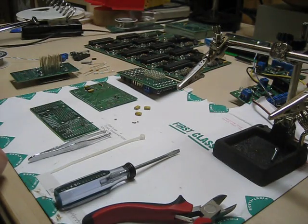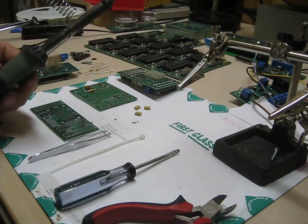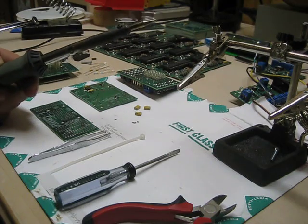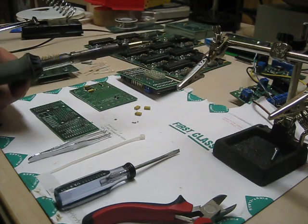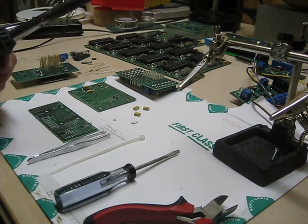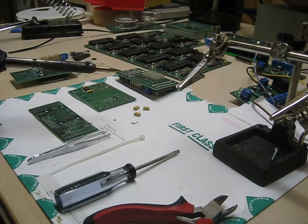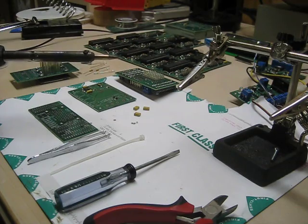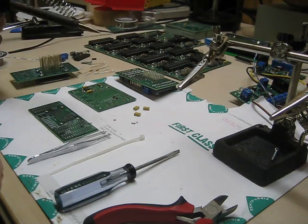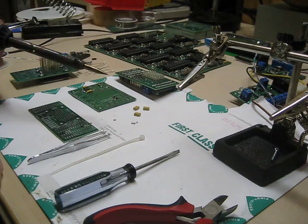The soldering irons I use — I have a regular solder iron with a large tip, about 40 watts. Anything less than 40 watts, you're not going to be able to heat it up enough to get the solder to flow really well in some areas. You can use a smaller soldering iron — Radio Shack sells a 15 watt — but there are a lot of things you're going to have real difficulty with only having that much heat.